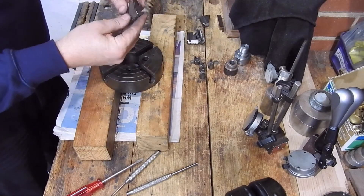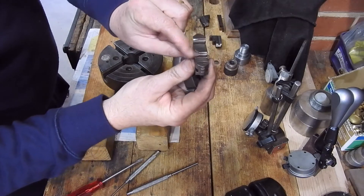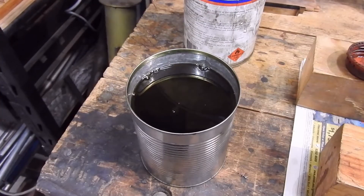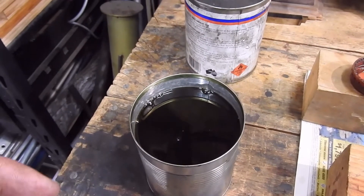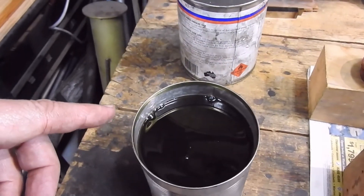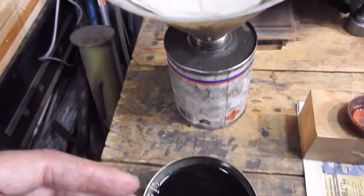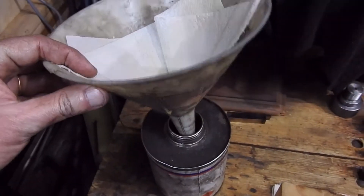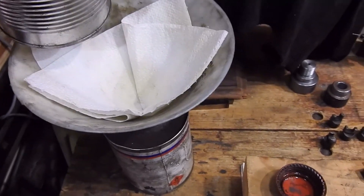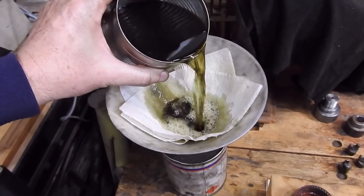To me that suggests this chuck is in not too bad condition. It's been in the wars — you can see here someone has taken a chunk out of the side of that one — but it's still in reasonable condition. The solvent is getting pretty dark, but that's okay because the fine dirt and metal particles are what I want to remove. What I normally do is use a household funnel and a couple of bits of paper towel, and run the solvent through it like a filter.